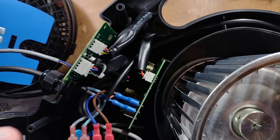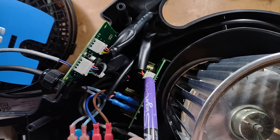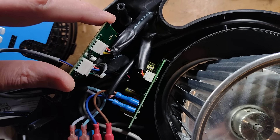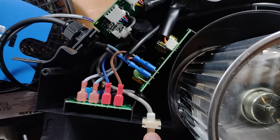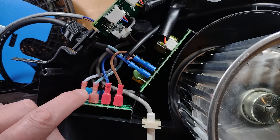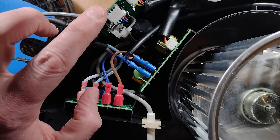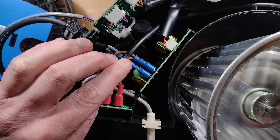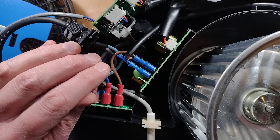This is a rather bulky device. Here is the fan — it's a dual-sided centrifugal fan. There is a 24 volt power supply down here, quite a complex power supply with auxiliary functionality, designed to take another switch feed in and signal over to the control PCB. The control PCB monitors a temperature sensor, and there's also an optional temperature sensor coming in via a connector from the external heater unit. The heater unit is switched via a card that has a looped mains feed and uses an opto-isolator feeding a triac. I got this from eBay a while ago — it was unusually cheap, and I think I've found out why: it's got what looks like a botched repair in it.